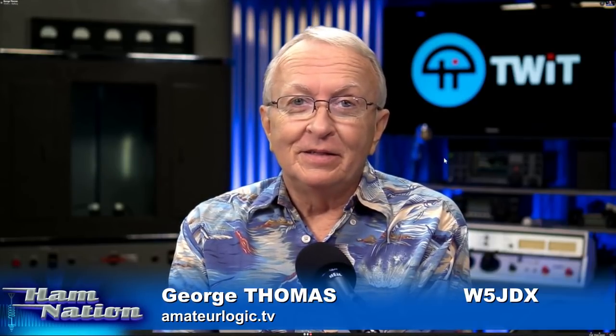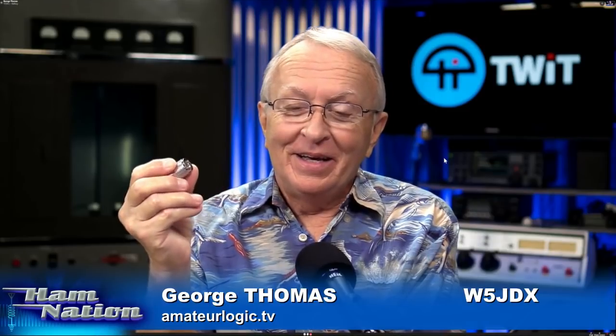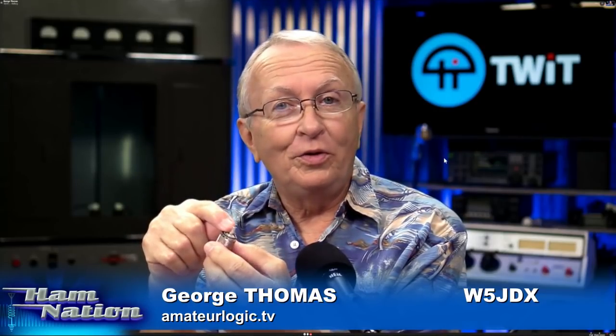Now, I have done some pretty odd stuff with RG58 and PL259s because there's really not enough on that cable to work with a PL259, but you still got to do it. I would say one of the best tips, and you mentioned it there, is to tin stuff before you actually go to solder it. Tin your shell, or the outer part of the PL259 where you're going to solder. Tin your center conductor before you ever put it through here. That's going to make it go so much quicker so you don't have to heat up things as much.